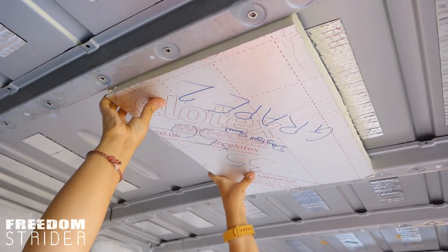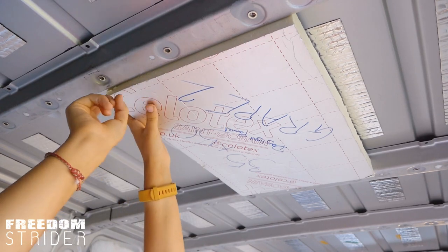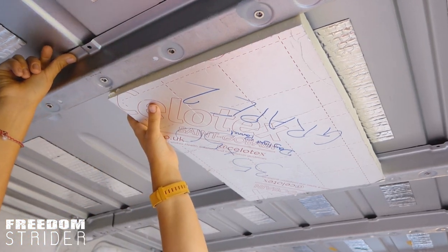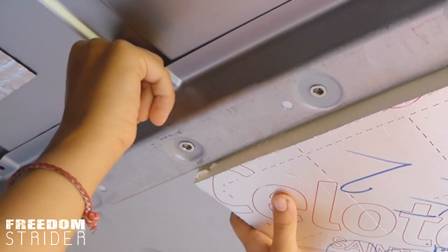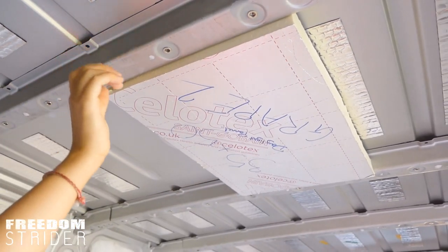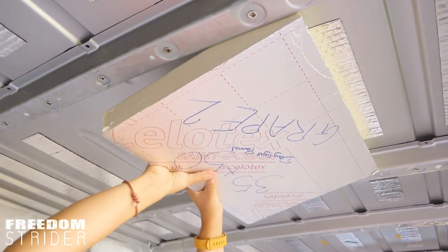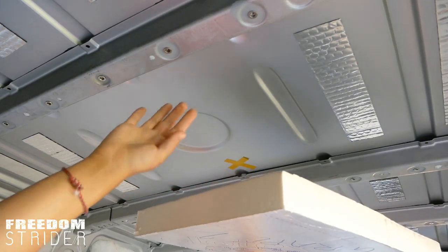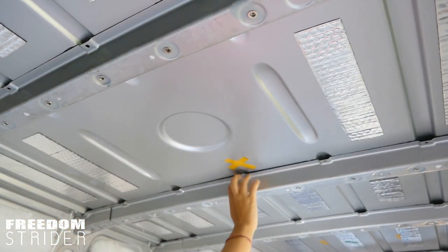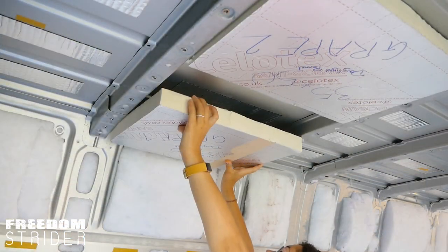This one sticks down a little bit more than we fancy, but it's not too bad. It sticks down because of the ribs — that's another five millimetres down which gives you the extra distance. So ideally what we should do is chisel out this corner so it goes with the groove of the rib, and I'll give it a little bit more leeway obviously.